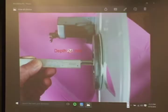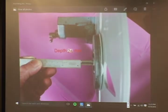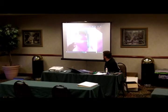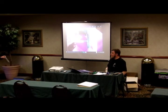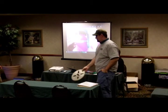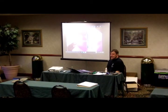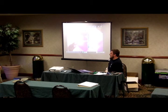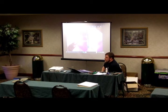Since we've got one of these, I found it's exactly 24 millimeters from there to there is where you set a JK platter. That's the dimension there. It probably translates to what you said in inches. I think your website at one point had a snippet of RCA saying it was 15/16. I think that's correct. So that's 24 millimeters? Probably, yes, equal to 15/16.